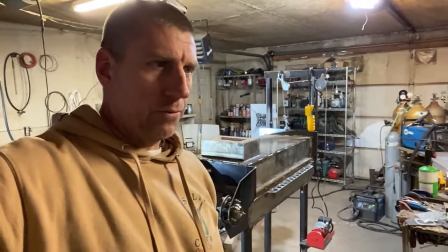I forgot to point that out in the beginning — how toxic that stuff is when you're mixing it up. You can't just go throwing this stuff into a bucket and mix it. Use a very powerful drill and an auger bit. If you rent a machine mixer, don't get one where the whole tumbler turns — that's not going to work for refractory. You have to have a paddle wheel mixer because of the low water content required. A rotating mixer will force you to put too much water into it.